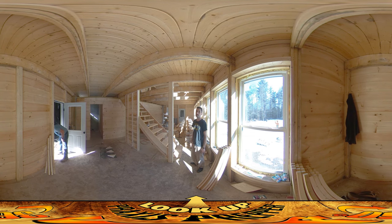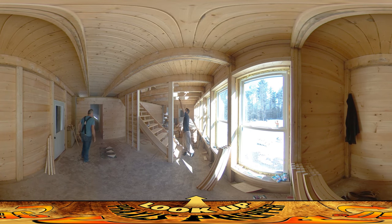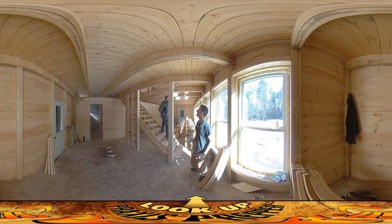Incidentally, this post isn't solid — it's hollow on the inside. We're going to be putting the light switches for going up and down all these stairs inside the post. It's going to be a five-way or six-way switch. A five-way means four light switches and one set of lights; a six-way means five light switches and one set of lights. The idea is you turn the lights on here, go all the way up, and turn them off at the top — switch on where you start, switch off where you finish.